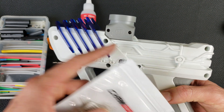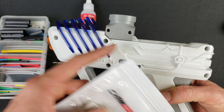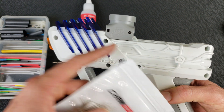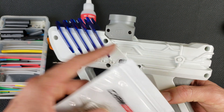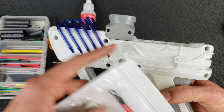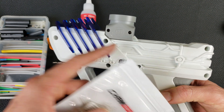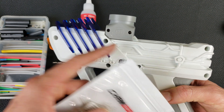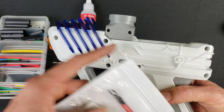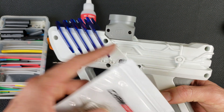Let's do a test fit for the LED. You don't want the LED to go too far into the piece — the T-piece is tight relative to the gels — but if you look at the gels there's still a lot of space even if I insert the LED all the way in. This hole seems to have become a little bit bigger than I intended, but I'm going to glue the LED in such that it's just barely peeking out. There's still plenty of space for the gel; it's not going to block it. I'm using thick super glue because I don't want it to run — if you use thin super glue it could run into your mechanism and damage or glue things together. I'm going to apply just a tiny bit and hold it in place.